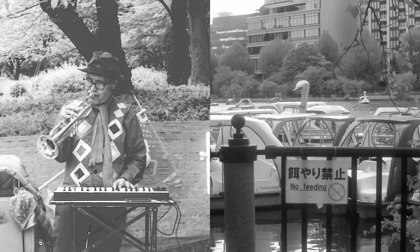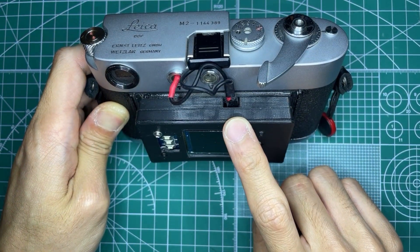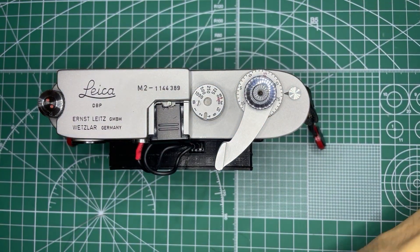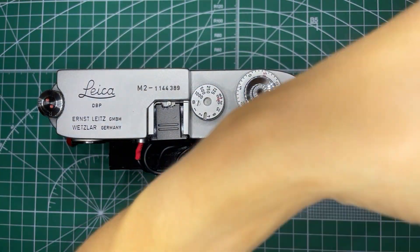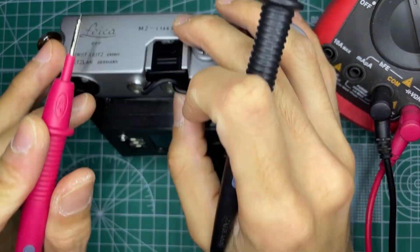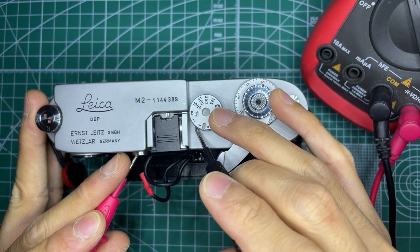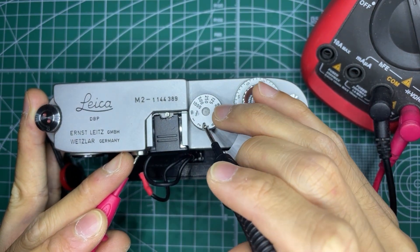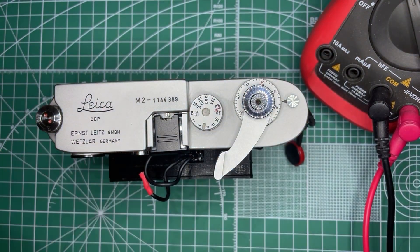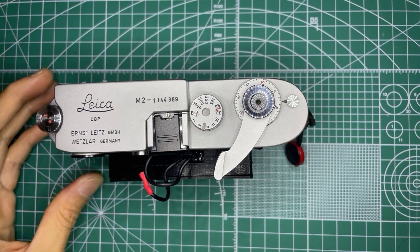The other affordance is the mechanical shutter, which is coupled to the electronic shutter on the Raspberry Pi. For this, I'm using a cable to the flash sync socket. To demonstrate with a multimeter and continuity checking — probing the center pin and ground, which is just any point on the camera body — pressing down the shutter will close that circuit, and I'm using that as a signal to tell the Raspberry Pi to begin an exposure with the electronic shutter.